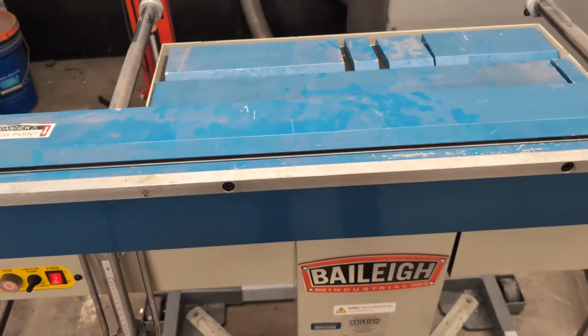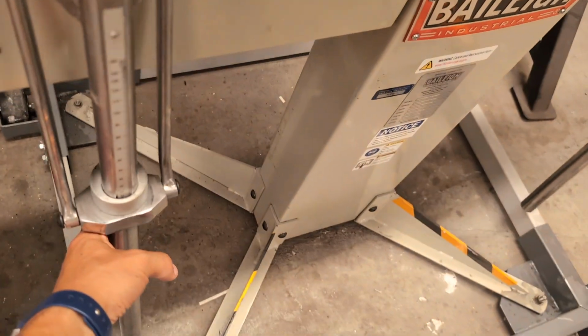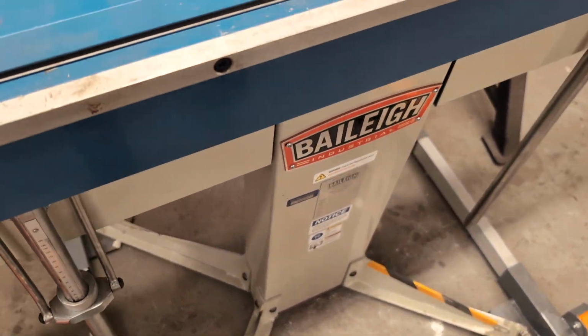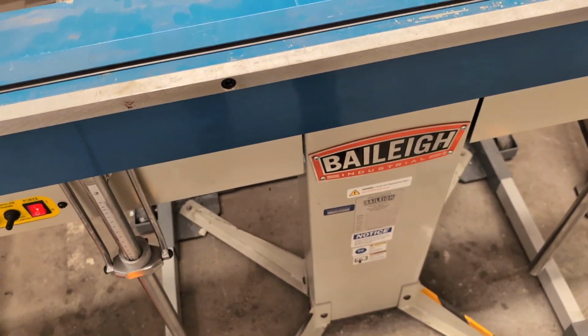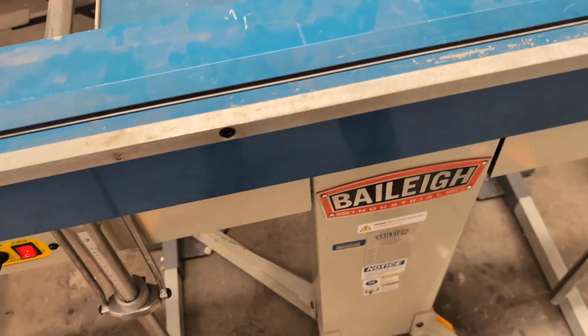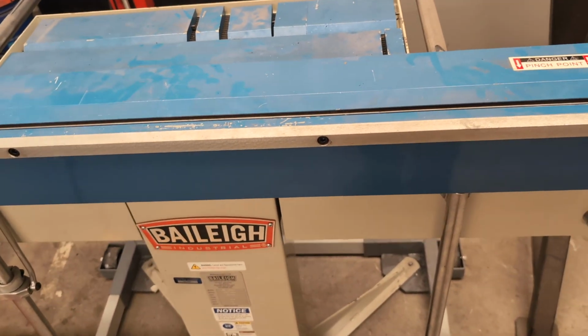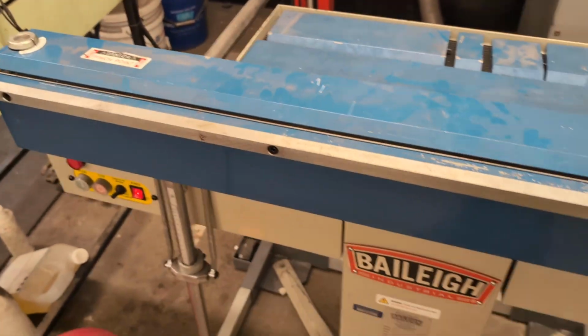3 other things to note are, 1, that you don't want to drop this leaf. So this guy down here, just let it down nice and slowly. You don't want to drop it. If you drop it, it can break the switch that's in there. And slamming these pieces of metal can also mess with their magnetic alignment, according to the manual. So make sure not to drop any of these things. Be nice and gentle with them where you can.